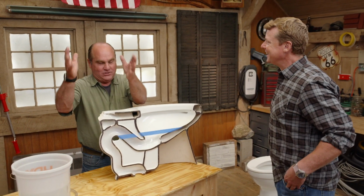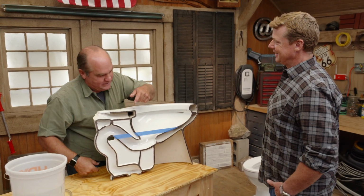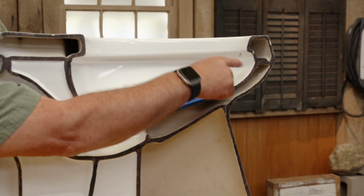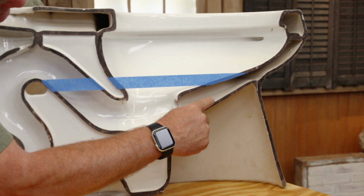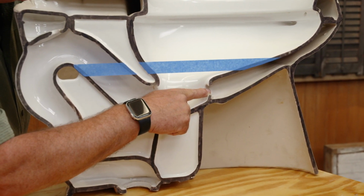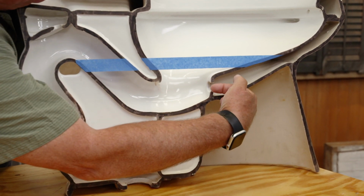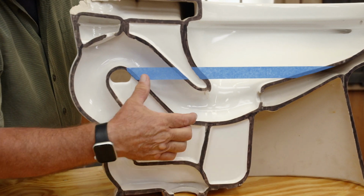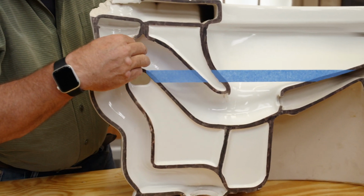So the tank is right here. When you flush the tank, water comes down into this flush rim. You see it right here? The water also comes out through here, but it also comes down inside the bowl to this little hole right here called a siphon jet. And that jet pushes water right up that short leg. And so if it does, it then fills this spot right here.